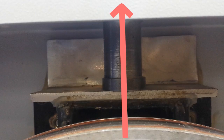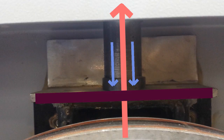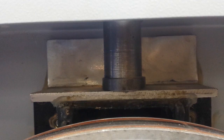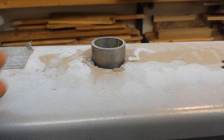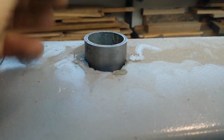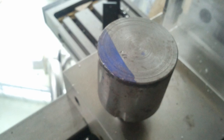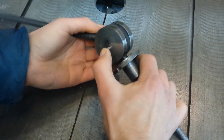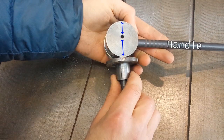One problem with the original mechanism was that the equal but opposite force coming down into the frame of the saw was way too much for the structure, so the cross piece bent and the tube on top of it buckled. Both of those were replaced with much beefier versions. Up on top, this quick release cam rider just sits on top of that tube. The cam itself is just a chunk of scrap that I milled down the middle, tapped a hole for the handle, and it has an off-center hole which the tensioning rod pivots on.